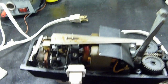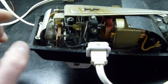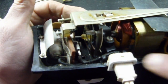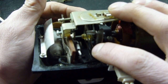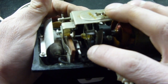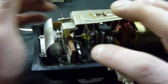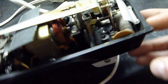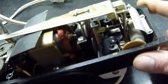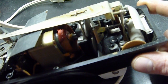Let's see how this thing is wired up and how this works. This is a little fan here, and we have a little spring-action flyweight right here that, as it spins out, contracts like that, pushing on that little rod which pushes the tab. And this is our actual speed controller right here — that pushes it back further as you move it to a higher speed.